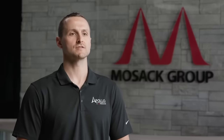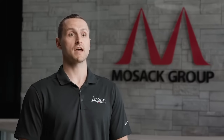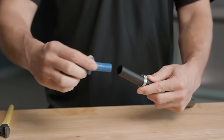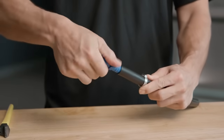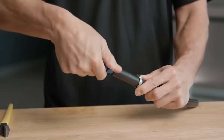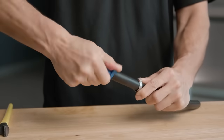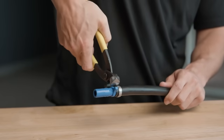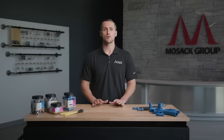Blue irrigation fittings are the easiest and best fittings to connect polyethylene pipe in irrigation systems. There's no need to hammer or walk them into the pipe. Just twist the fittings clockwise into the pipe and let the double helix design pull the pipe onto the fitting. Once the pipe has been covered, all the barbs, and fastened with a stainless steel pinch clamp, you are assured a connection that does not leak and will withstand the water pressure of the irrigation system.